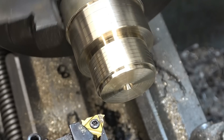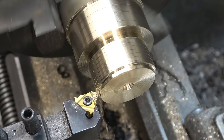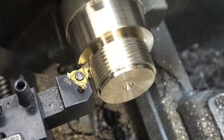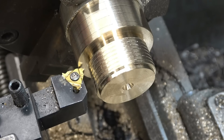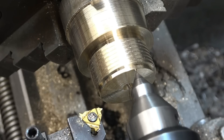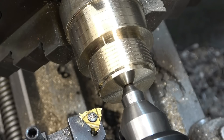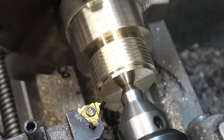Alright, so we'll put a bit more depth of cut on — 0.2mm I think it was. Right, so now it's actually cutting the thread. The thread is 1.49mm deep, so I know that once I go in 1.49mm the thread is cut to full depth. Once again we've stopped in the groove, out of the way, reverse the lathe, then we'll put the tool back into zero, a little bit of cut, and it goes on and on until I get it cut to full depth. There was a little bit of chatter on that last cut, so I have to say to put a tailstock centre in. I put a centre mark in anyway so I might as well use it — it certainly wouldn't do any harm. This is my favourite centre, it's a really robust one, really accurate. I'm just making sure I've got plenty of clearance between the end of the tool holder and the chuck, which I have.